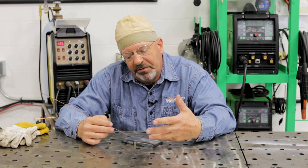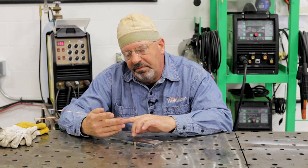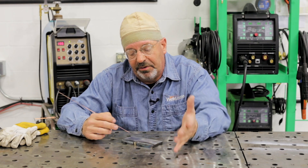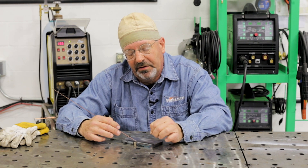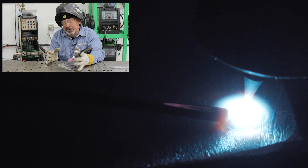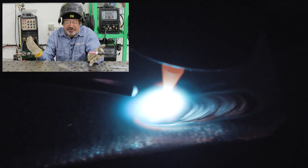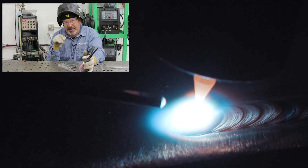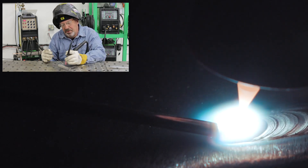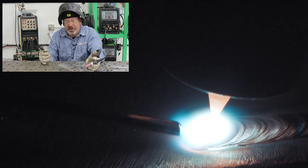The first thing is we need to find that focal point. Whether you wear bifocals, trifocals, straight readers, or no correction whatsoever, we've got to find clear focus at arm's length with whatever you use. Here's a perfect example: I'm going to make a weld and I'm in a position I'm comfortable with. My line of sight as I'm sitting here is right into this — I can see where I'm going the entire way. I'm comfortable and I'm at arm's length.